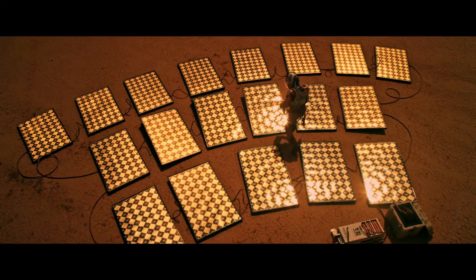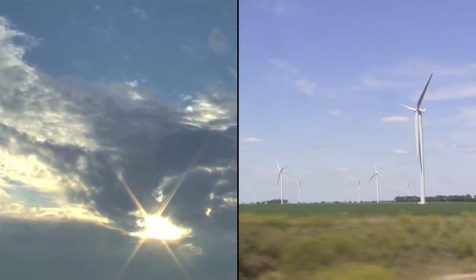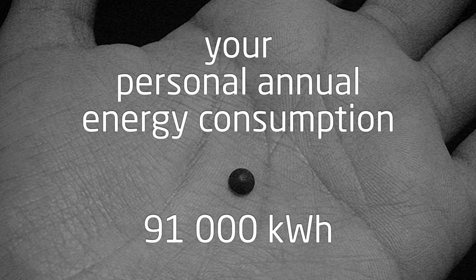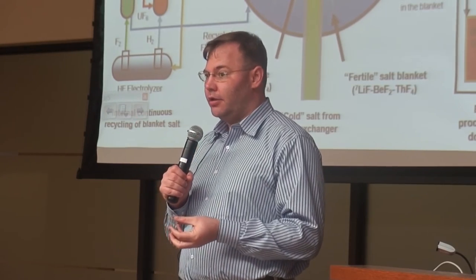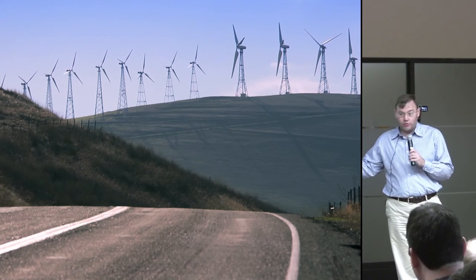The promise of abundant clean energy has already been made by wind and solar advocates. However, those are diffuse and intermittent sources of energy. Thorium, when consumed in a molten salt reactor, is incredibly energy dense, and it can follow energy demand. We demonstrated it at a number of different power levels — you could change the load on the radiator by moving the doors, and the reactor would follow the load. As the salt heated up, there would be less fissile material in the nuclear reactor core, so fission became less likely. Conversely, as the salt cooled down, there was more material because the salt was contracting, and fission became more likely — an inherently stable system. With wind and solar, you can't change the rate of what's coming at all — you just take whatever you're going to get.